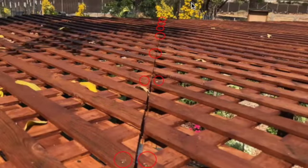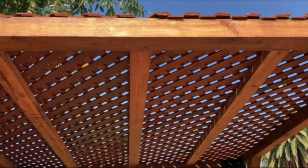To screw the middle lattice, you're going to do the same as you did for the left and right lattice, all except this time, you're going to be screwing both lattices onto the same 2x4. Make sure to start off with screwing one screw onto the 4x4 frame, and then just keep on going evenly spaced out until you reach the other side, and then screw the other screw onto the 4x4. This is how it should look from a bottom view.